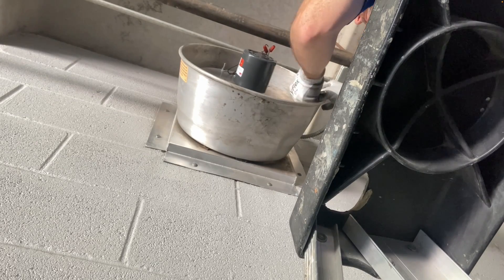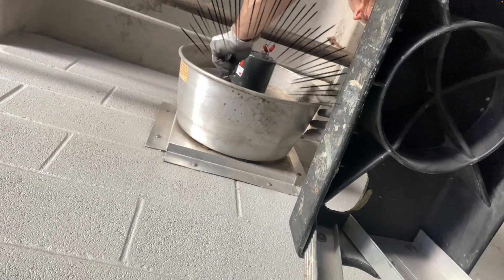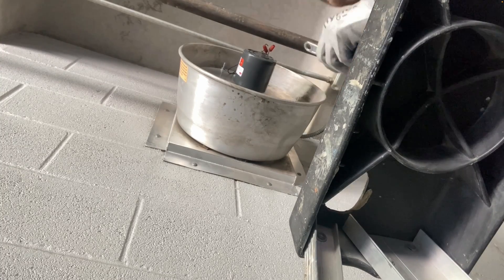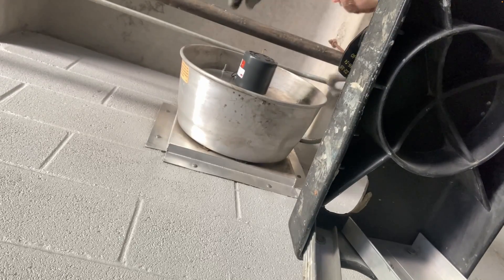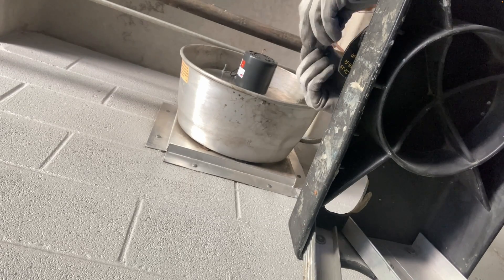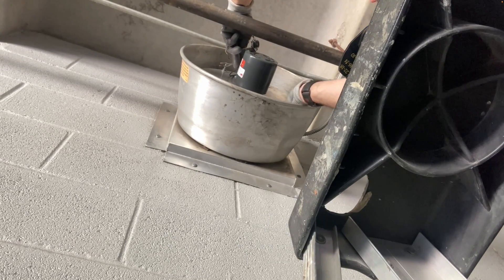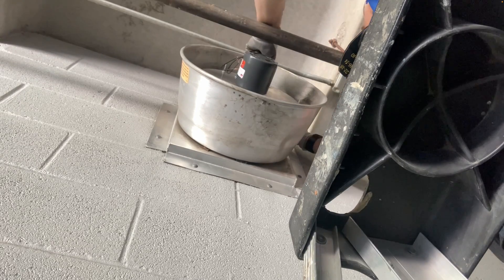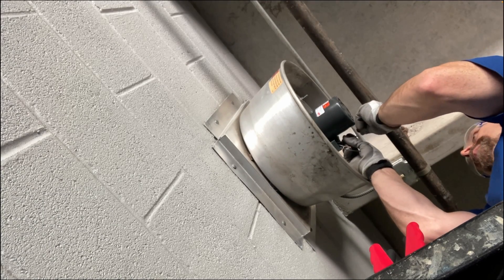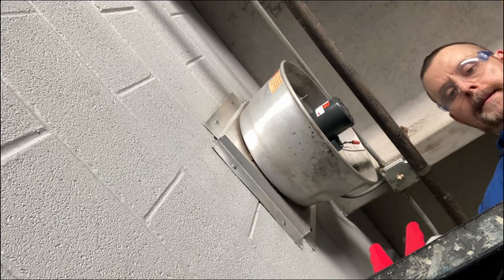How do you know if it's spinning in the proper direction? Once you hook up your leads and test it, the air should be blowing out of the building towards you. The old motor's junction box was mounted directly to the motor itself. This new motor's junction box needs to mount to the side, or on that top plate. It's not screwed to the motor, but it's tucked against the motor so that the motor hood will still fit on.